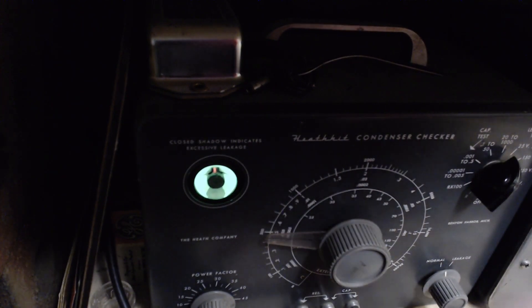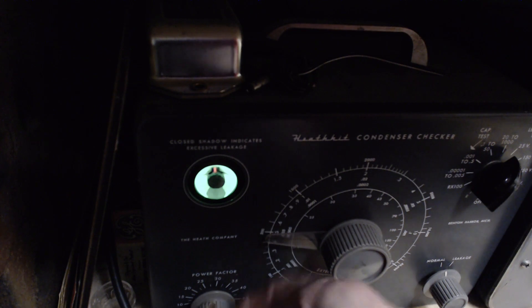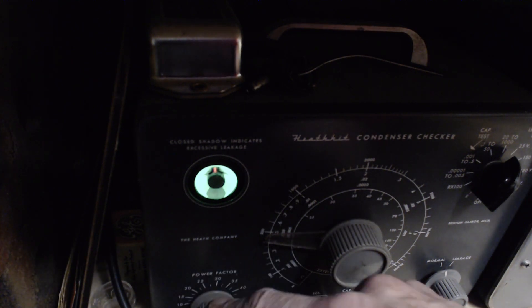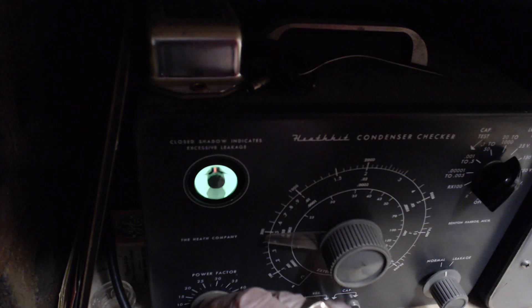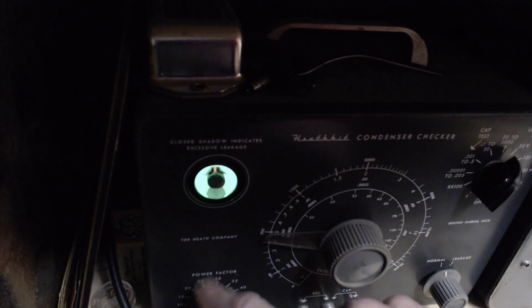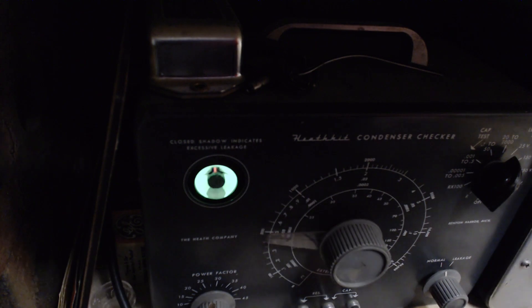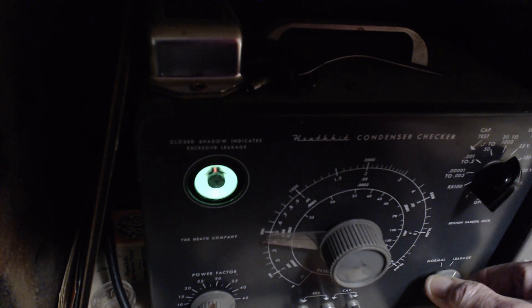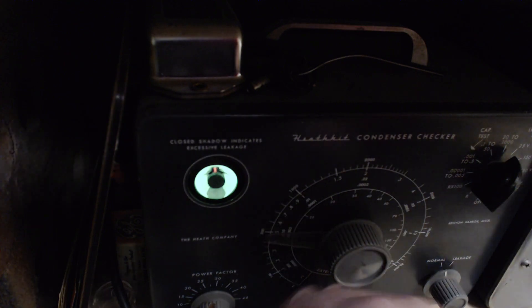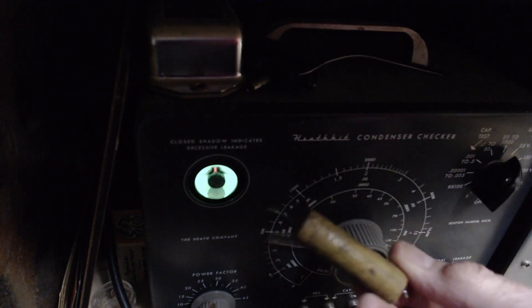Come in for a close look here. The last time I tested a capacitor, I had this switch still set in the electrolytic position. That last capacitor behaved a little weird and didn't leak nearly as bad as I thought — that was because of the switch position. Had the switch been in the right position, that capacitor would have tested much worse. Okay, so we're ready now at 50 volts — not coming open, nope. So this is as bad as my tester can indicate, basically.